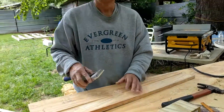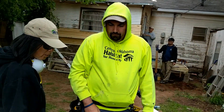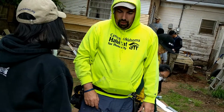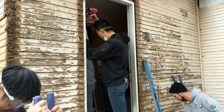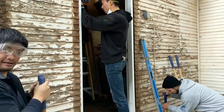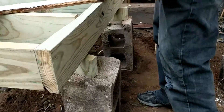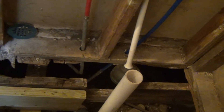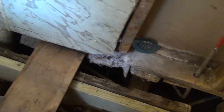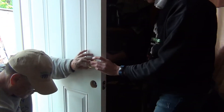Besides, it was temporary — everything's temporary until it's been there for 15 years. So we're going to make it longer: 103 inches with a 12-degree angle. We're going to put a leg on it — we have two legs — and put it underneath the house after we use a jack and lift the house up. The floor was falling down, the angle was off by six or seven inches, so we jacked this beam up and put the leg on there temporarily. We're doing the same tomorrow, putting a leg on here to bring this corner up also.